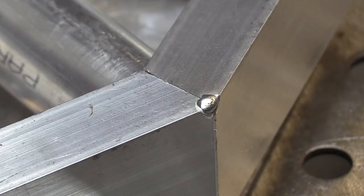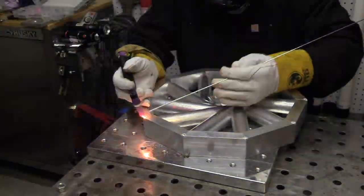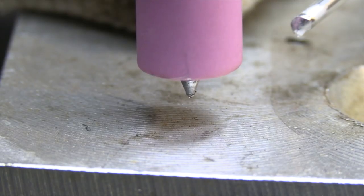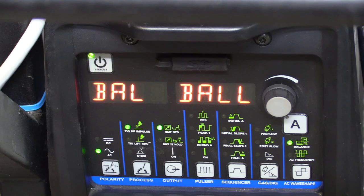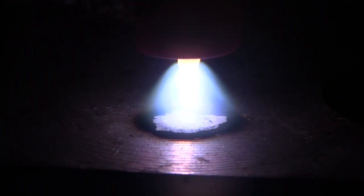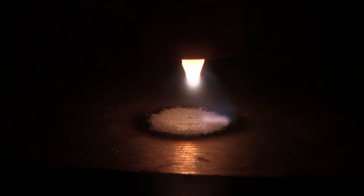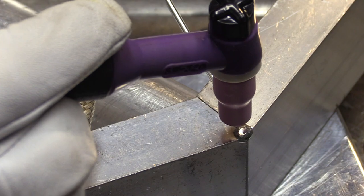When I'm going to weld these out at a little higher amperage, the tip will have a tendency to misshape a little bit. To prevent that, I'm just going to ball it slightly on a clean piece of aluminum. The Dynasty has a ball feature — any machine can be used that way if you set the cleaning to max. I'm just going to light up on a chunk of aluminum and give it just enough foot pedal to put a nice rounded tapered tip on there. That'll pretty much stay like that because I'm only going to be at maybe 80 amps on this stuff.